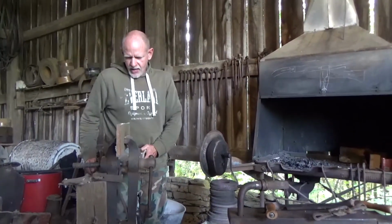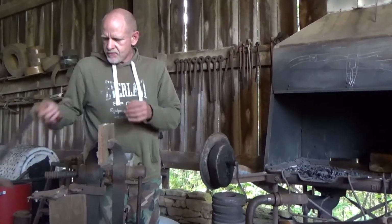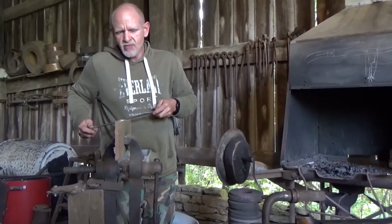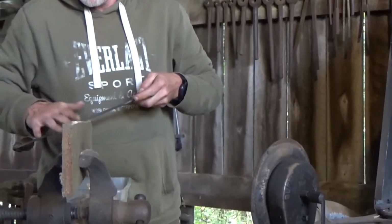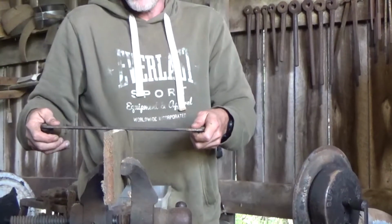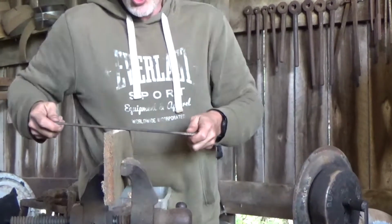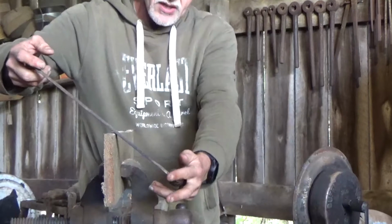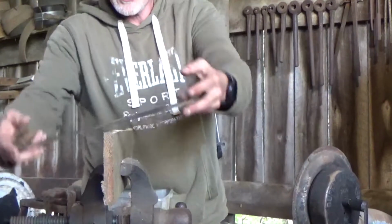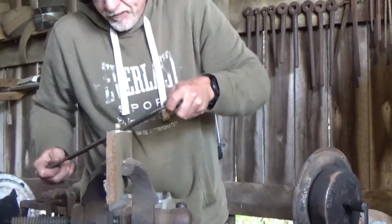By putting the box right up underneath where I'm going to be working, this catches the shavings. Utilizing the draw knife to go from the full size of the board back to myself, I'm going to pull the shavings as long and as good as I can. I'm not going to rough it or do something really hard and heavy. I'm going to use the grain of the wood with good even strokes, and I'm going to utilize the left side, the top side, and the right side, or sometimes I may utilize the right side, the left side, and then come back on the center as I make my strokes. So let me show you.